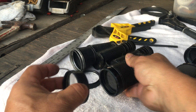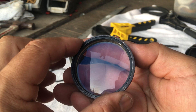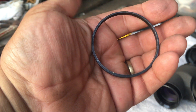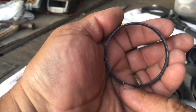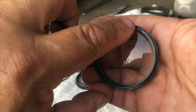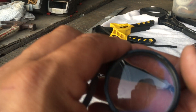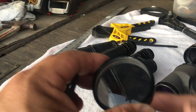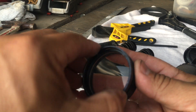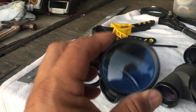Here is the locking ring — very standard and typical. Now here's the whole housing. I told you the black was part of the housing, and there's another piece underneath the locking ring — and here it is. If you look closely, you'll see one side is thicker and the other side is thinner, and the lens housing is the same way — one side thicker, one side thinner. Binoculars without the eccentric ring system will not have this loose ring that's thicker on one side.